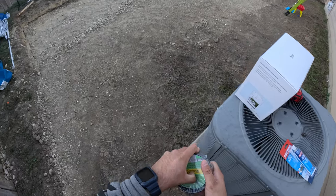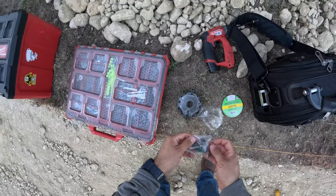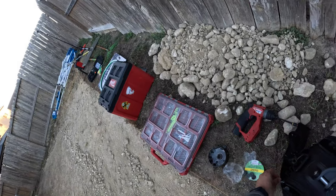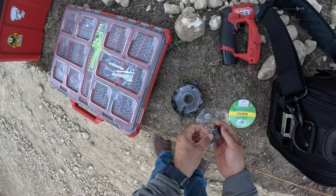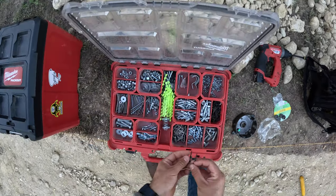The next thing is to add a round outdoor rated outlet box — that's going to be where the light's going to be mounted, and it will be supported using some wood screws onto the house itself. The box comes with some half-inch knockouts and those can be threaded onto all the holes that you don't end up using to make sure that we keep it weatherproof.